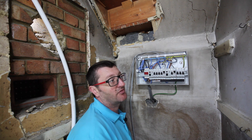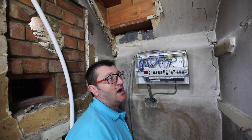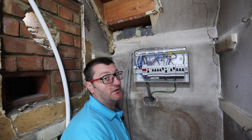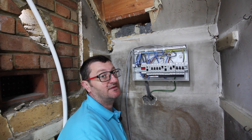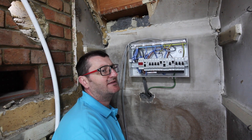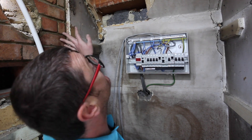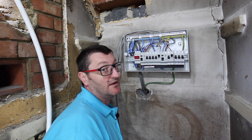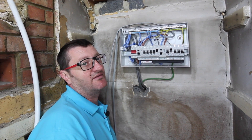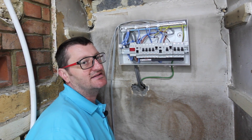It's going to be a three-story house in the end because we're going to add a loft. So I have a ring for downstairs, a ring for the first floor, a ring for the loft, then lights for downstairs, lights for first floor, lights for loft — that's six circuits. To that I'll add a cooker circuit, so that's seven, and the gas boiler is just going to go to the side of the consumer unit, so I'll probably just have a little radial circuit for that. So I'll be looking at eight circuits.